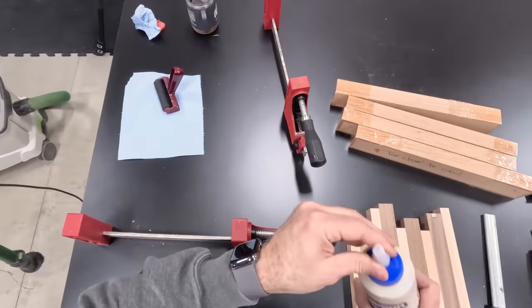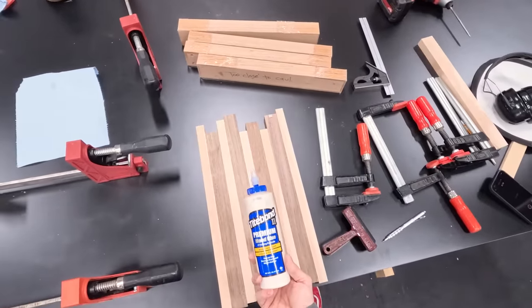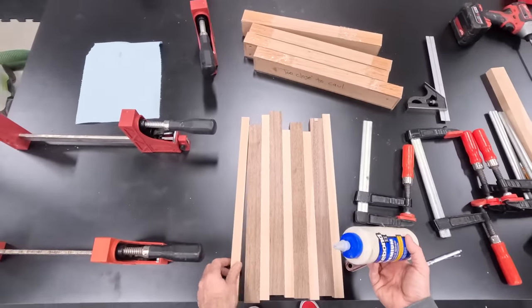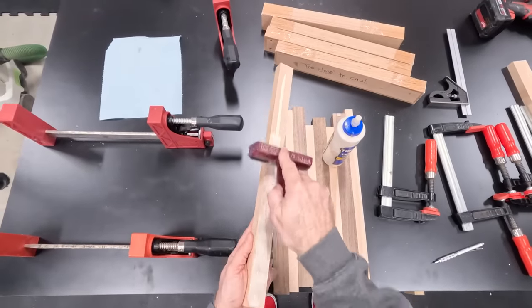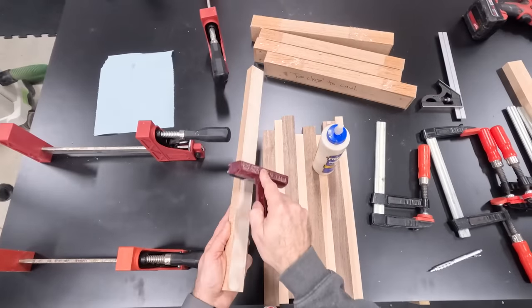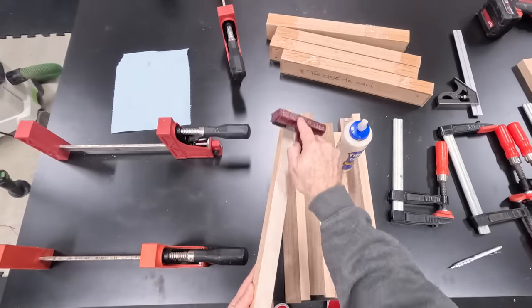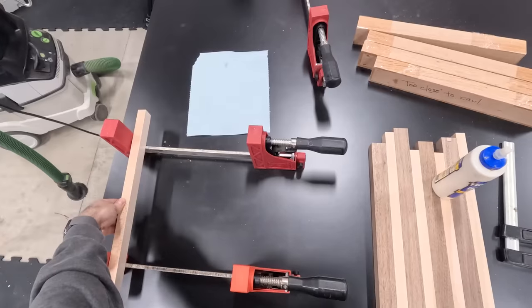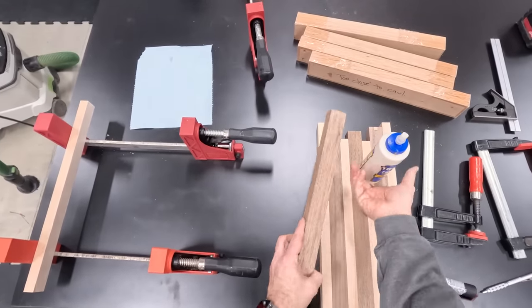Everything is staged — just want to make sure I've got everything where it needs to be. Got a roller, got my glue. I'm using Titebond 3 — this actually is a two-bottle but it's got three inside it. You can use a judgment call whether you need to put glue on both sides. You see how much I have on there? That's quite a bit, and when the layer is that thick I am not necessarily inclined to put it on both sides of each joint, so on the next piece I'm going to skip.